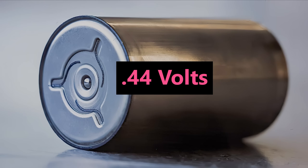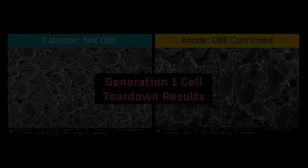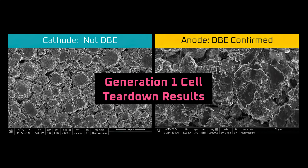One thing I didn't show in that video was that the battery cell had a voltage of less than half a volt, which meant it was likely damaged. Due to that damage, doing electronic tests to calculate its energy density would have provided inaccurate results, so we didn't proceed with those tests. That won't stop us from doing materials testing on the cell, and I'll release all that data in the next video.